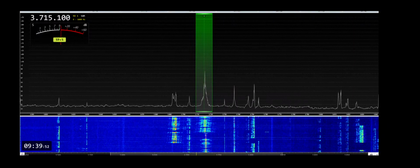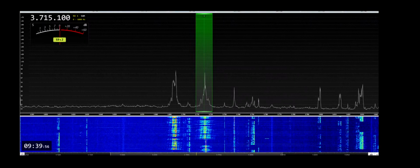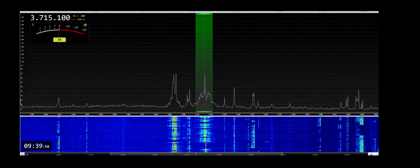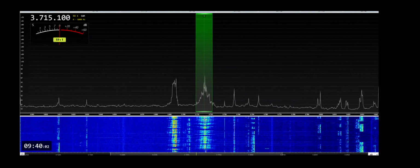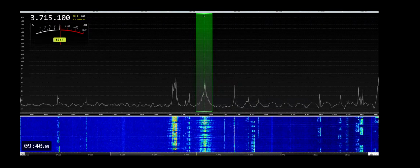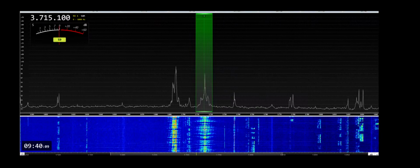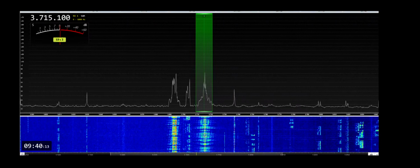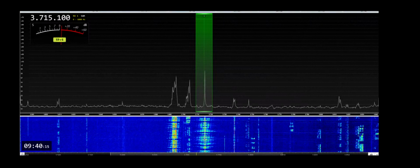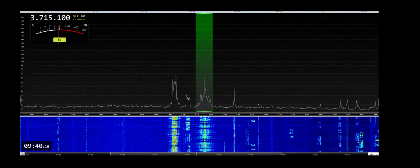The last time, looks like I'm reaching 100% on the modulation of the AF-68, and I'm curious, where did you put your... I think I'm talking to Gary now. Where did you put that control for the driver? I'm looking at the schematic, and I would say in the cathode of V4. And what value did you use for that pot? And it is a 1 watt resistor that's in there now.